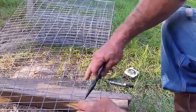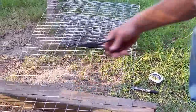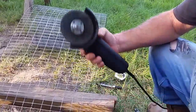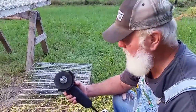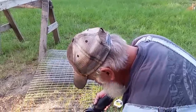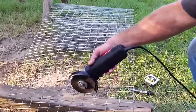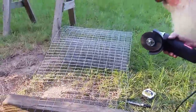This will be my guide wire with it on top, and I'm going to go straight down the side of it with this cut-off disc. It's a sixteenth-inch disc — it's a cheap Chinese grinder I got at Harbor Freight and it's good enough to cut wire. I'll go down the side of this, just like this, and that's going to guide the disc and it's going to be a perfect, clean edge.